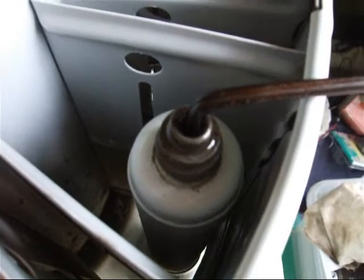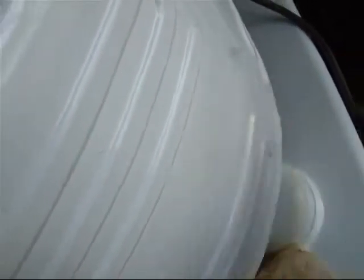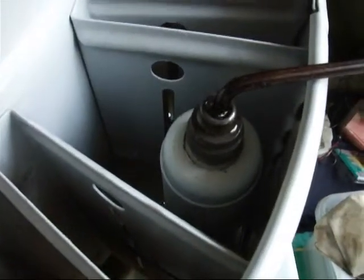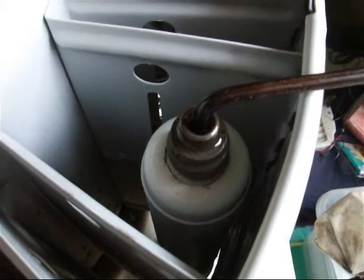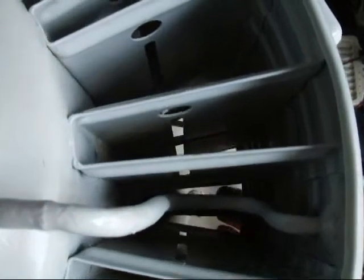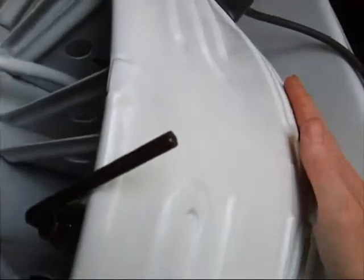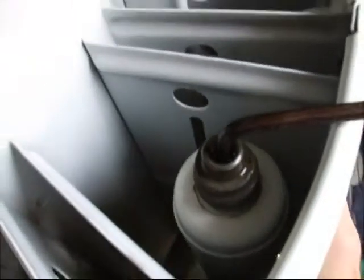In another three minutes I'll close the valve and repeat the procedure until the bottom of the condenser starts to warm up. I won't show all of those procedures as I've been through it enough times to give you an idea of what's required. By the feeling of the condenser it's getting quite warm down here. This point here is the end of the condenser — the high side tube that runs into the float chamber is taken from that point. So if that's warm, that means all the non-condensables are out of the condenser, which is what we want. It's probably almost time to finish.